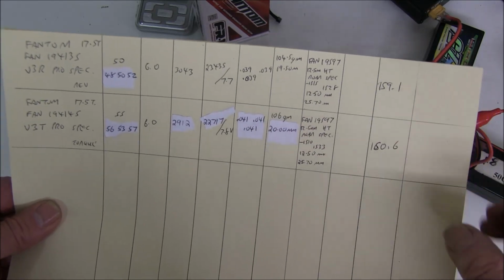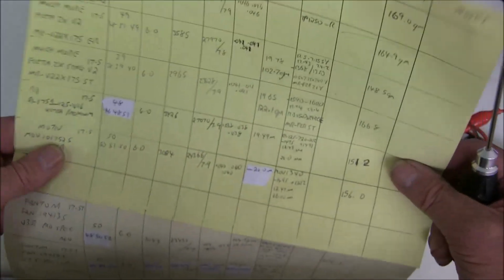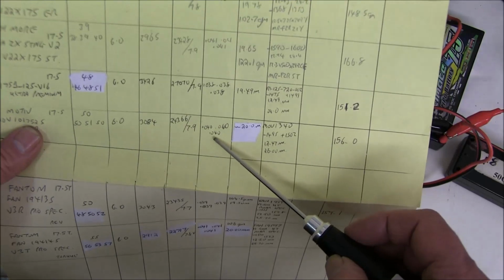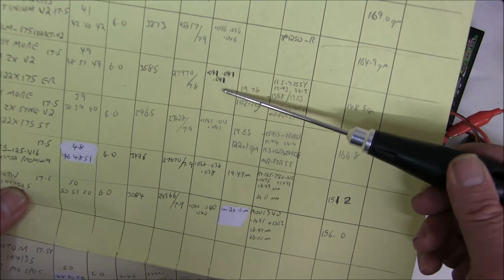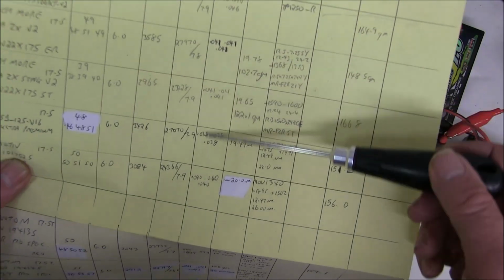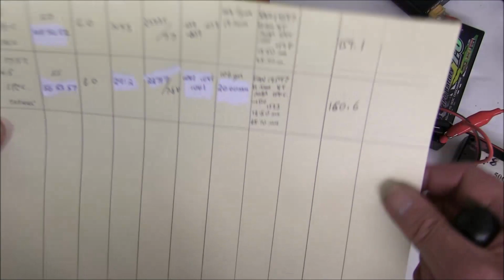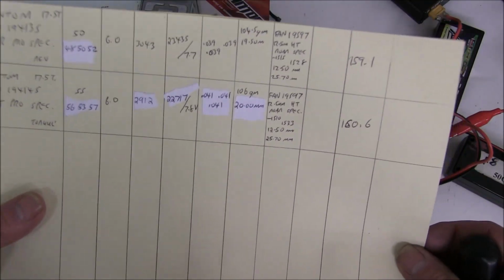The lowest resistance I measured before was on the R1 at 0.038. Motive was 0.040, and generally much more 0.041. So this area here is what you're going to get with the windings. You can't go any thicker wire. You've got to put the number of turns on. You can't go to any shorter stator.